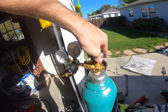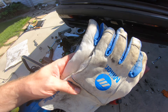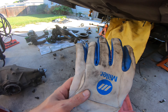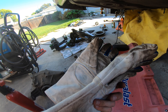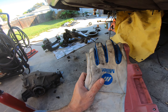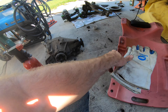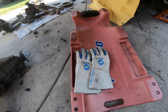I have 0.035 wire on. A lot of times you see people on YouTube welding without gloves — that is really, really stupid for a few reasons. One: obviously you'll burn yourself. Two: you can't get into the work as well because you're scared of the heat. Three: UV burn. You want to put on a long-sleeve shirt at minimum — an FR-rated shirt — or else you can get a UV sunburn that can give you skin cancer.